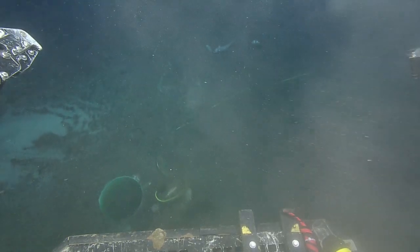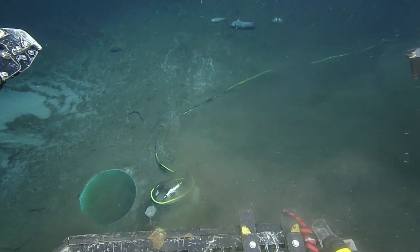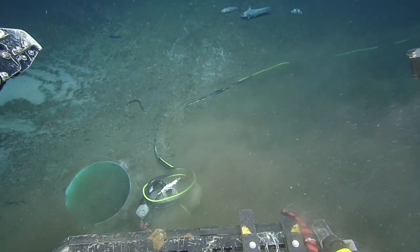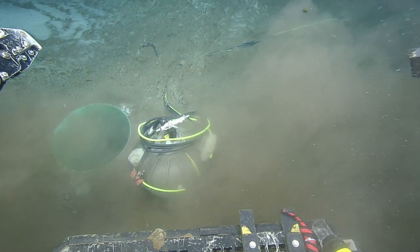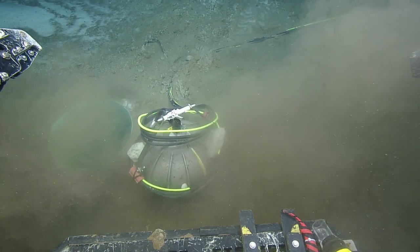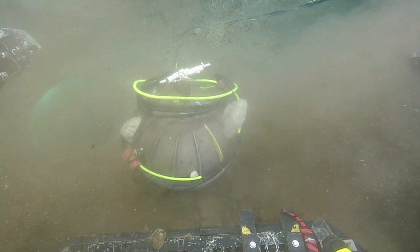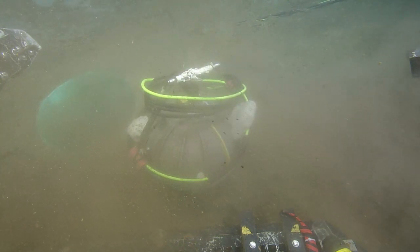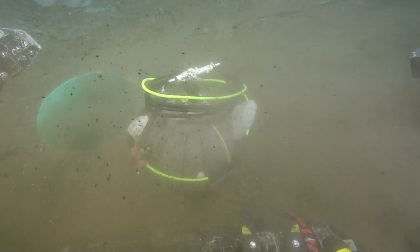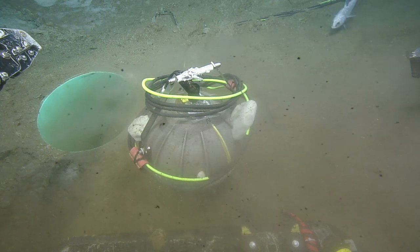So, Jeff, this one is fairly well strain relieved at the end. Yeah. I think the only one I know for sure wasn't was that new one we put in that doesn't have the mechanical handle, that just has the bridle, so it probably didn't trigger my memory to strain relieve that one. Okay. Well, what's the plan? Can we grab this guy at the top, but off to the side, to avoid any potential contact with that connector? Yeah, we have to pick this seismometer up and walk it back along its cable.